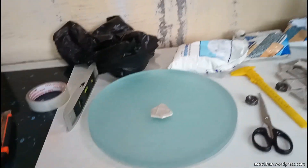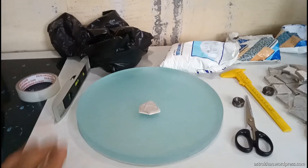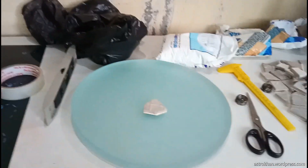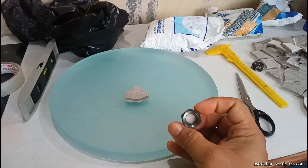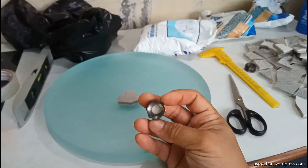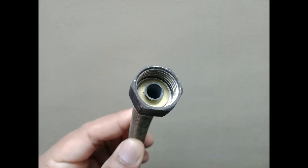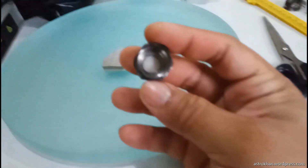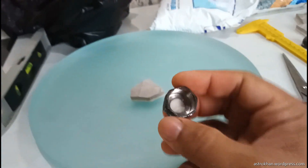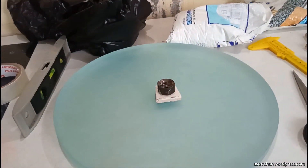I will pour the cement on the dam and once it is hardened, the tile tool will have the matching curve of the mirror for the grinding process. I am also planning to make a mirror-o-matic, so I will place this hexagonal kind of hose connector at the centre of the tool while casting it. You can take these out from some old water heater hose. I broke it open from an older water heater hose and I will put it on the mirror while casting the tool.